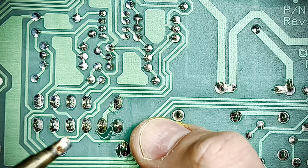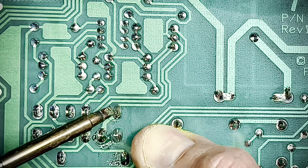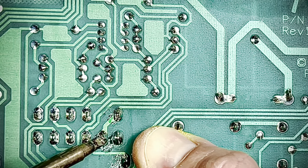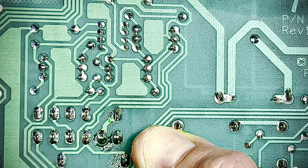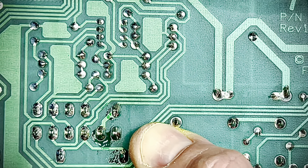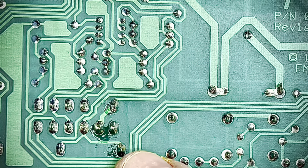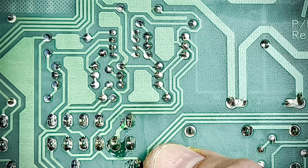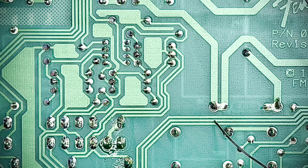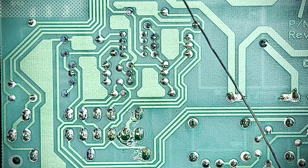The whole purpose of this is just reseat. Nice. Felt it move. Boom. You get that little millimeter of movement indicating that it's seated. Look at that. And what I'm going to do now is I'm actually going to remove a bit of solder from, I'm actually going to clean off 2 of these joints, and then I'm going to make a mechanical connection here just to strengthen up, so we're not relying on a straight lead being glued in with solder. That's not what you want to do. I don't even know if I'm capturing this for you guys. So look at that. That's terrible.